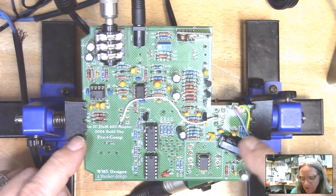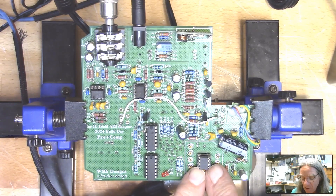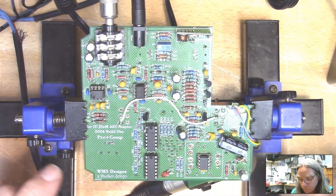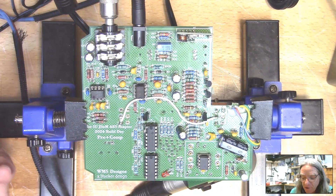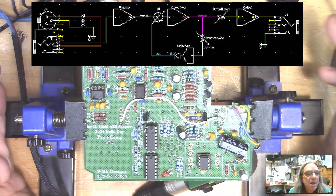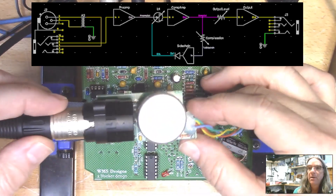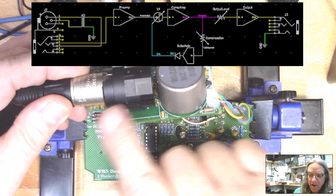Just a little bit about how this works beyond the controls on the front: the mic preamp is here, right now on an IC op amp, but there's also an option to use a discrete op amp. I've got signal going in. So the first thing I want to do is look at my circuit and find a midpoint. Here's the block diagram: we've got an XLR coming in to a transformer, and that transformer is on this separate board, because of the height the XLR needs to be. This is an XLR combo jack — quarter-inch and XLR.